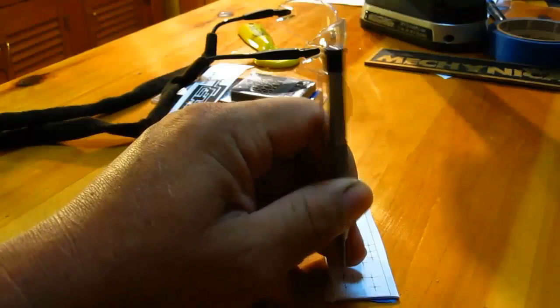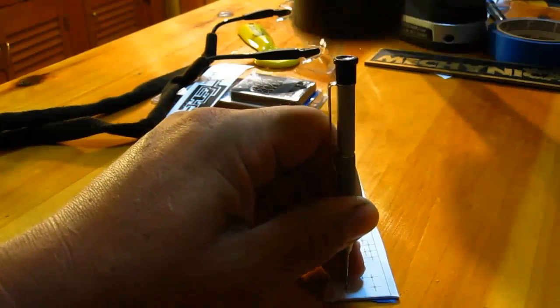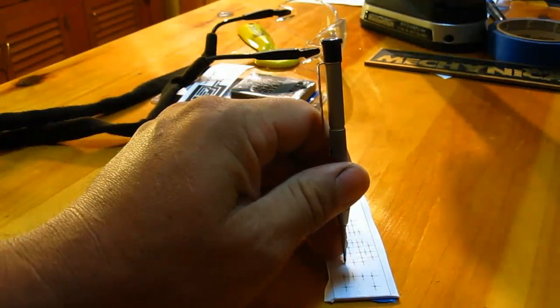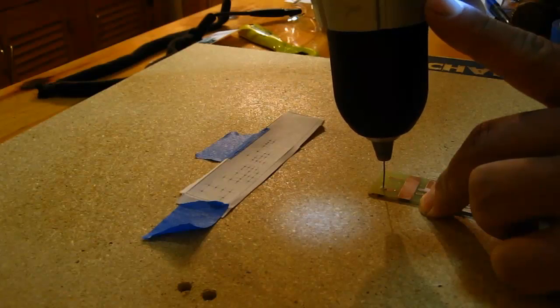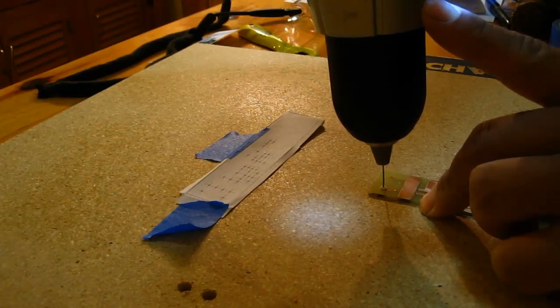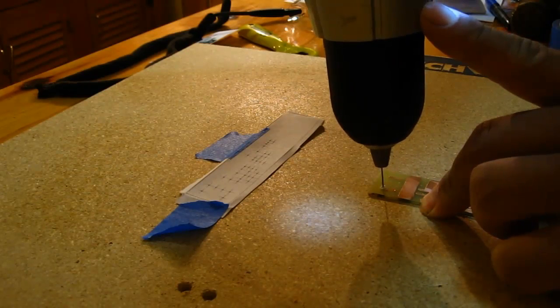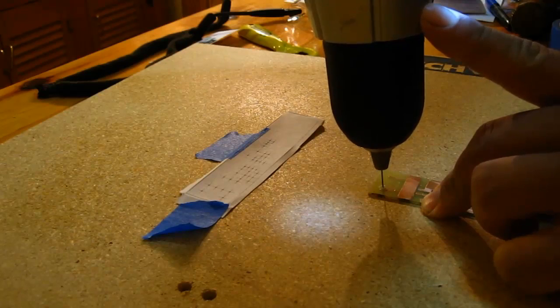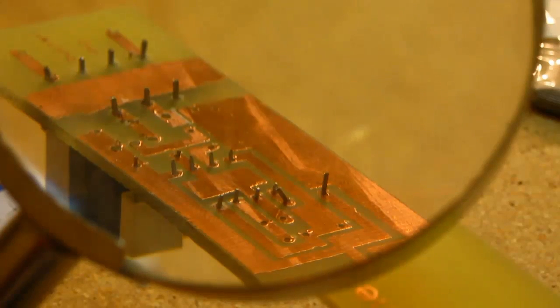Cut out and tape the whole template in the PDF to the circuit board. Use a center punch to lightly mark through where you'll be drilling the holes. Now carefully drill all the holes in the required spots. The sizes are indicated on the PDF. The bits are small, but you should be able to find them in the Dremel section at your local hardware store. Insert all your components in the required spots and solder them into place.